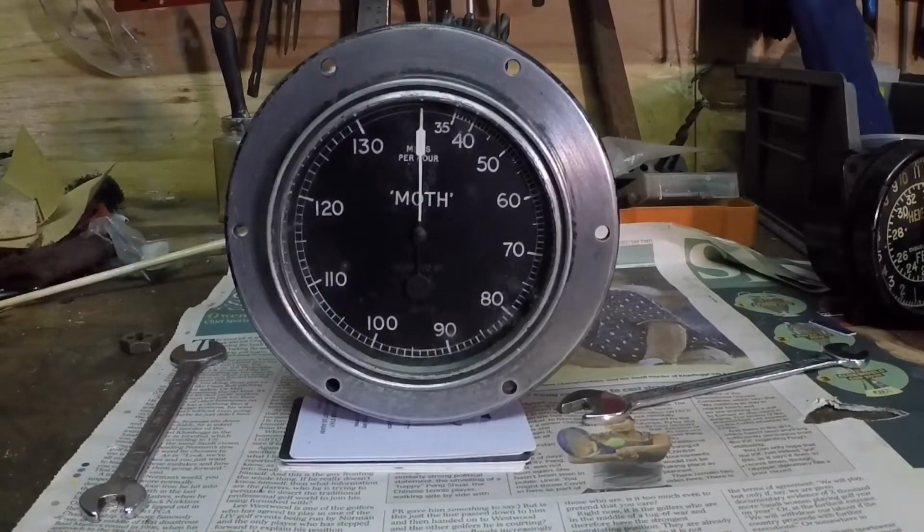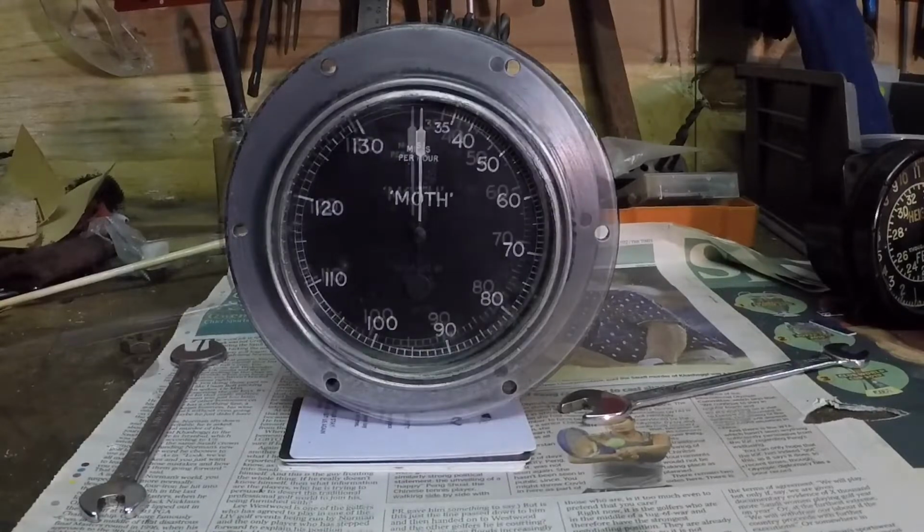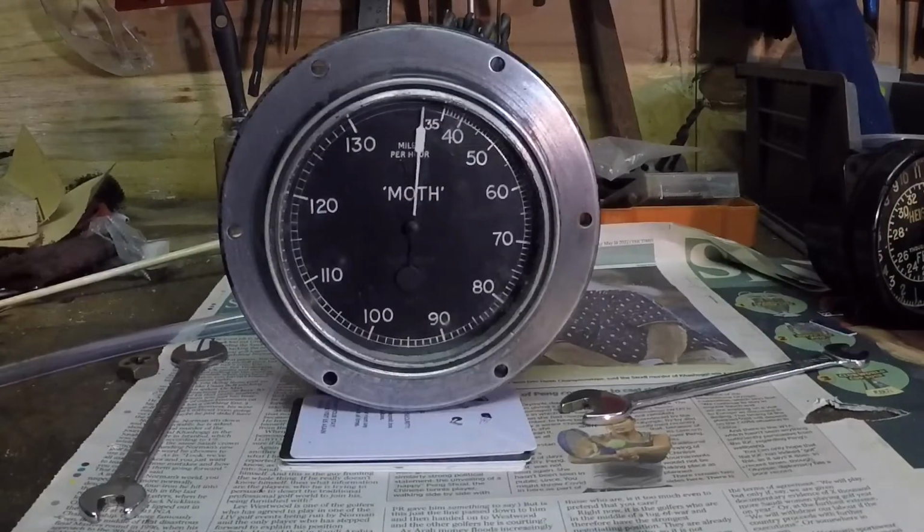The altimeters I can't really do much with, apart from zero them before a flight, leave them on the aeroplane seat, and then climb to 1,000 feet or so and see if they work. With the airspeed indicators, I can attach a rubber tube to the pitot port, and blow down them. I had to blow like hell to get this Moth one to work at all, so I'm not sure it's going to work in flight. The highest reading you'll see on the screen was me absolutely puffing like hell, and I don't live on cigarettes either.